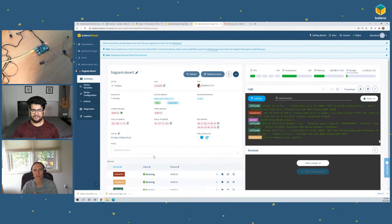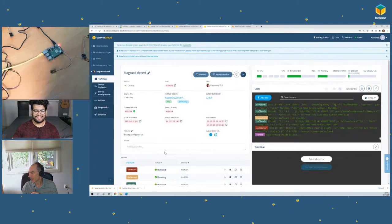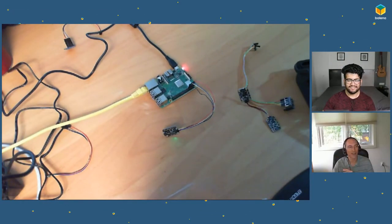So is there anything else, Alan, you'd like to show about this project, or any very common thing that people can get stuck on, and the solution to that? Anything coming to the top of your mind? No, I think we covered the basics. There's hopefully not a lot to get stuck on here. It's really a matter of making sure that the sensor is supported. That's important because we don't support every type of I2C sensor. Make sure it's compatible and make sure that it's connected properly to the Pi. And then once you have that, it's almost plug and play.